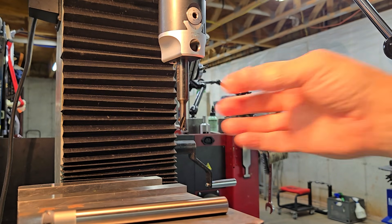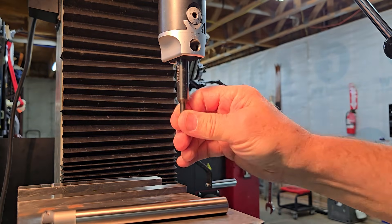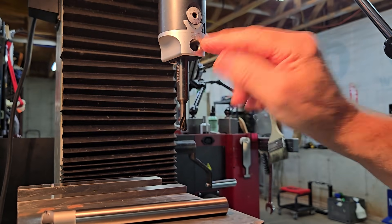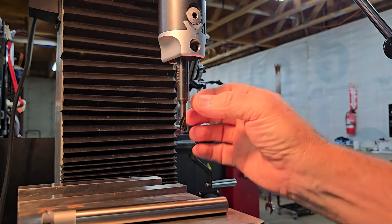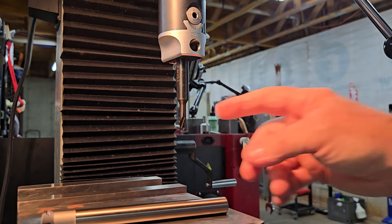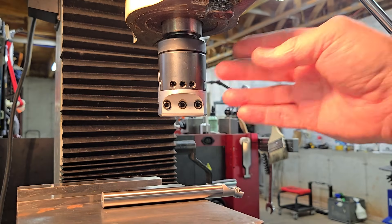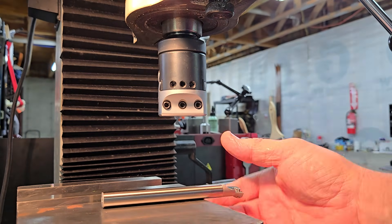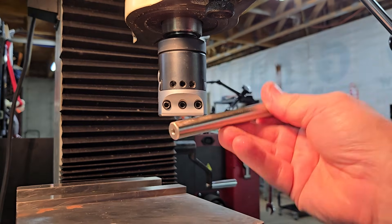You can see that turns right on center, and that's true with all boring heads — that center hole, when you center the boring head itself, is lined up with the center of the spindle. So its minimum is the true minimum of the boring bar. Now when it comes to the maximum boring diameter of a boring head, which again there isn't one — it depends on the length of the boring bar.